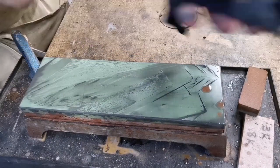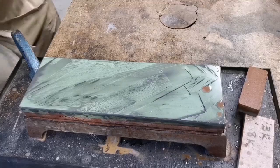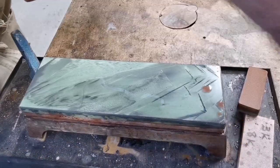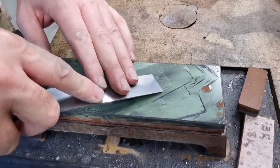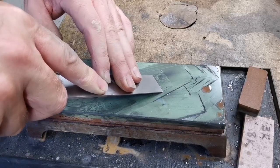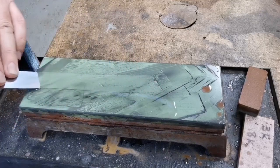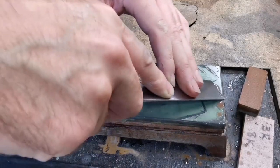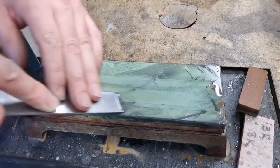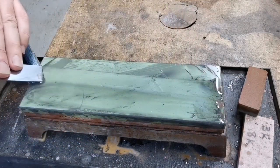Give that a wipe down and that's it — that's the back of the chisel done. Now I'm going to have a couple of spots of water; don't bother with the spray, spots of water is great. Put it on an angle again, lift it up — see the moisture come out the front? And that's my 25 degrees. Just a little bit higher than that. Gently push it forward, locking the hands and arms. We're not going to dig into this gorgeous stone.